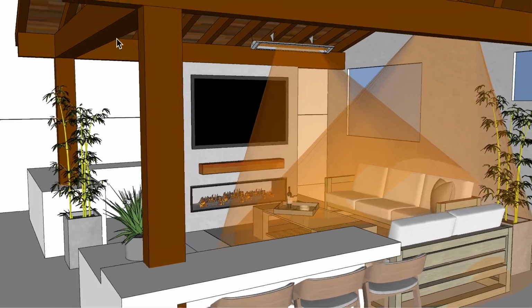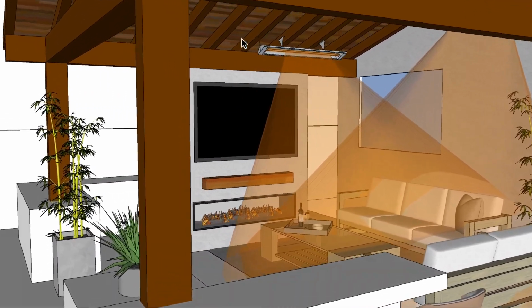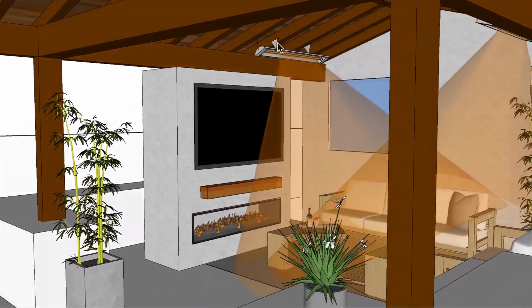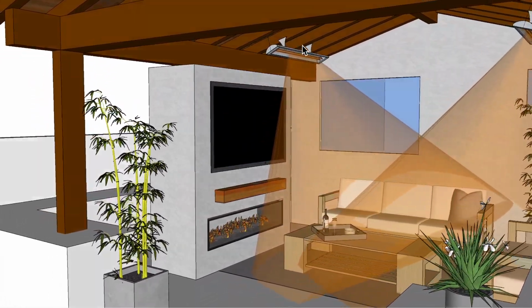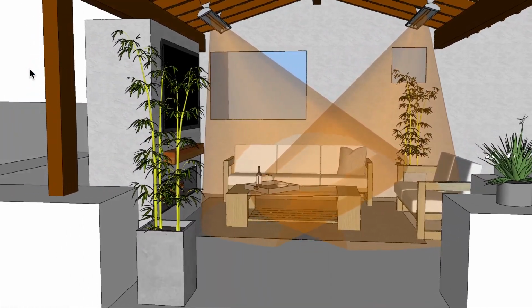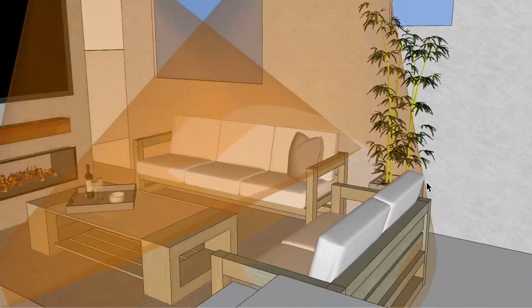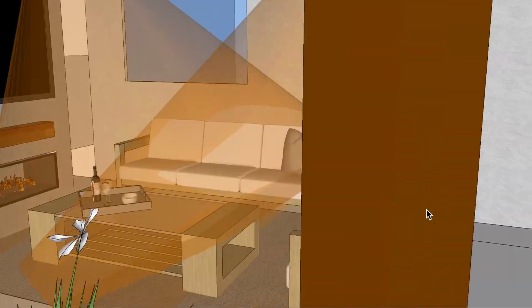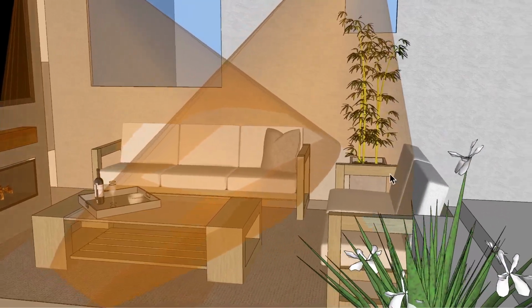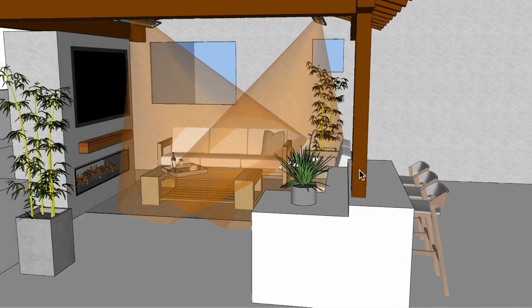That 8'6" bottom edge of the beam here, I think that we have this at about a 10 or 12 inch high beam. So we're almost another 9 foot off the ground on the mounting. So you can see with two 6,000 watt units, I think that would be just fine for this location. The chairs over here are just barely getting hit on the full seating position of the chair. You can see I have that right at the beam here practically.